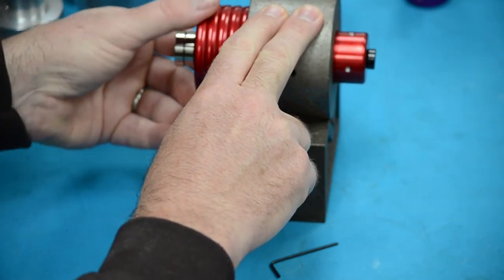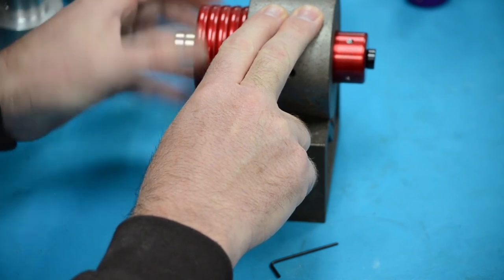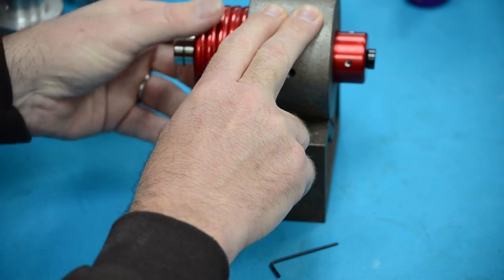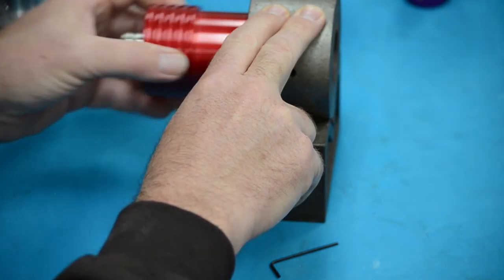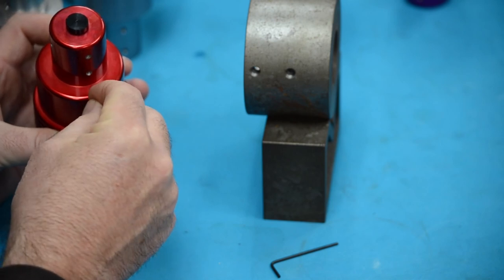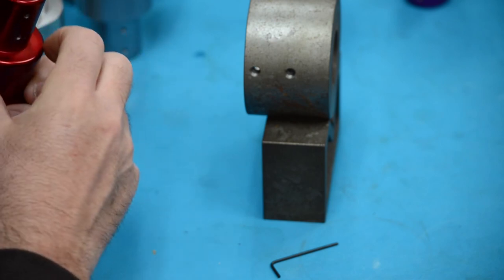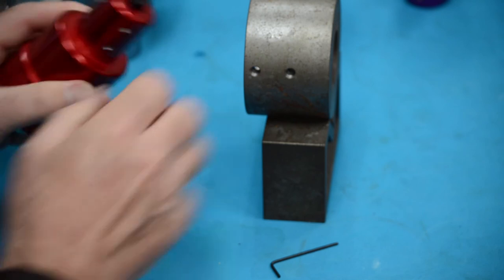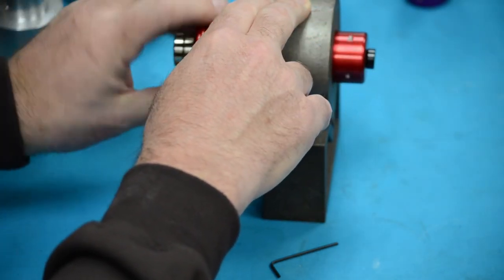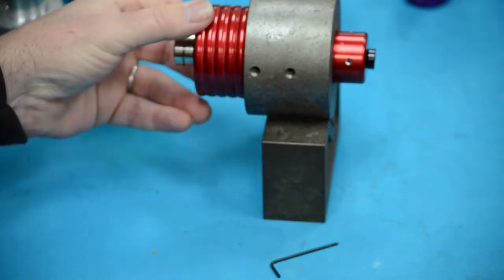And so you project the laser down as far away as you can, a nice 80 feet is good, and spin it, and the laser beam shouldn't move. If it is moving, then you might want to mark an arbitrary 12 o'clock, 9 o'clock, 6 o'clock location on the laser so you can figure out which of the collimation screws you're going to have to tighten and loosen in order to move the beam back into collimation.